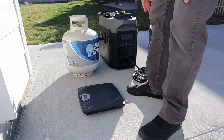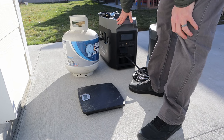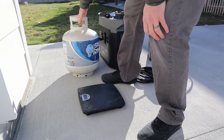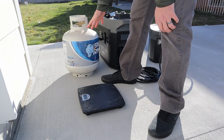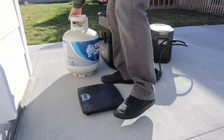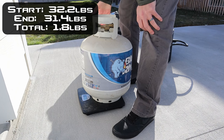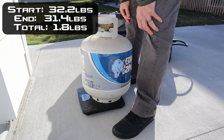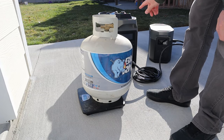The second test just ended — I really like that this auto shuts off on the DC testing. I've unhooked the propane bottle. We started at 33.2 pounds after using two pounds on the AC output test. Now it's sitting at 31.4 pounds, so we used 1.8 pounds of propane on the DC test versus two pounds on AC. It does appear to be more efficient when using the DC output.